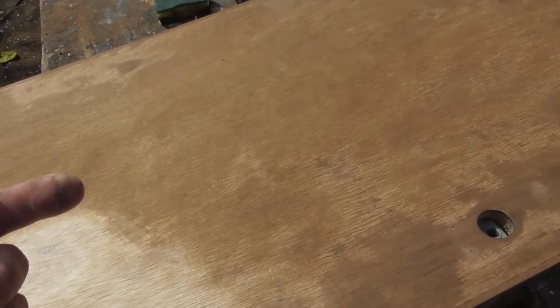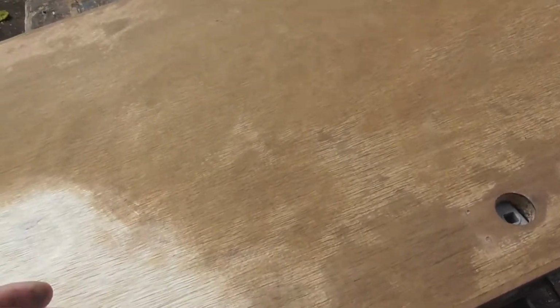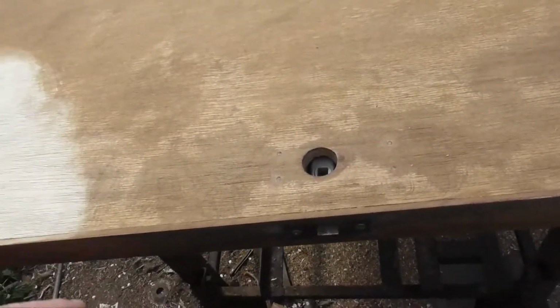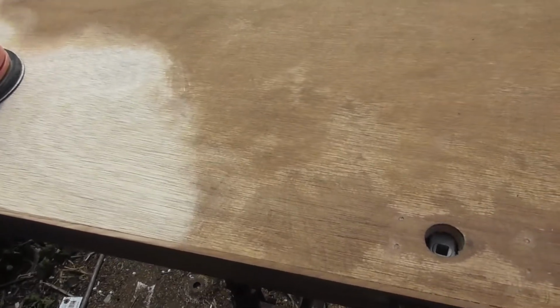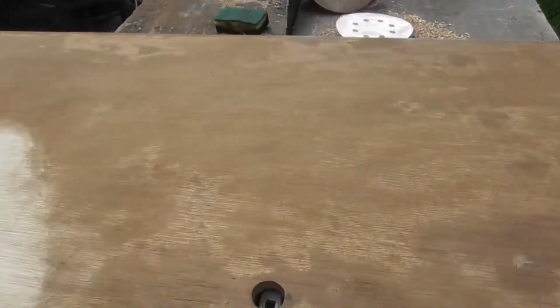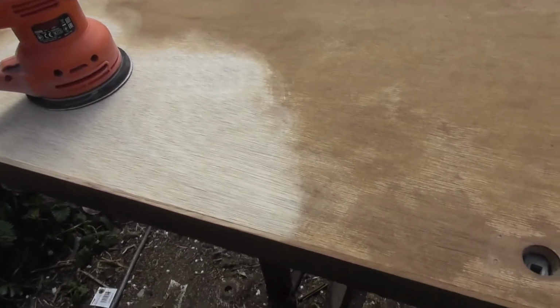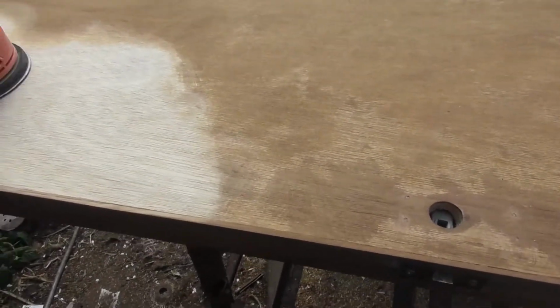And I have used the worst surface, because there's two surfaces, there's another one underneath. I've actually used the worst one for the front, when really I should have switched it around, because this could have been painted white to match the interior, but I didn't want to have to recut hinge grooves out, which is what I got going on here. I just really wasn't in the mood to do that, so this was the easiest of the two evils. We'll see how it pans out. If I can't get it any better, then I'll have to switch it around.